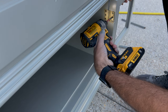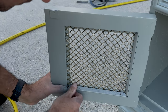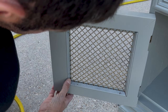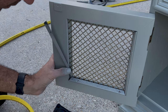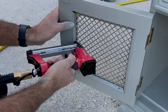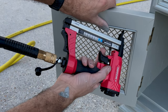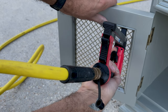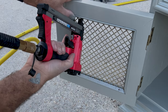I'm just putting some hardware back on here — nothing fancy. I'm going to dry fit everything and make sure the styles are in the right place. With something this small and intricate, it's really good to make sure you dry fit everything and shoot all your staples in the middle without blowing out any corners, because if you do, you've got to make another piece. And that's a lot of time and setup for such a small task — it's almost not even worth it.